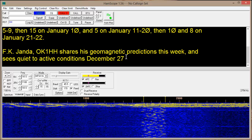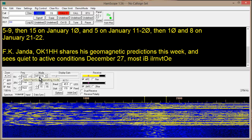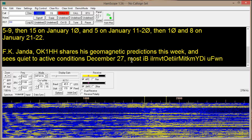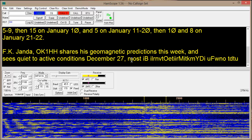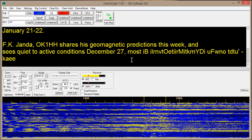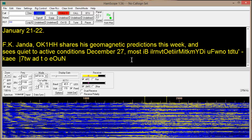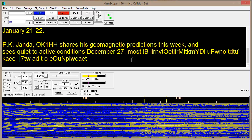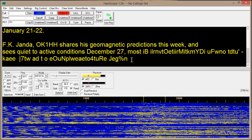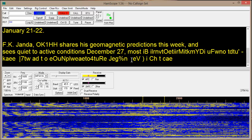Do you see how that's coming in in blocks like that? The reason it does that is because MFSK16, the mode that's showing up right there, has what they call forward error correction. It checks to see whether it's getting things right, and that takes a little time, so it checks every few characters to see if it's probably getting things right. And it's almost always correct when it thinks that it's getting things right.